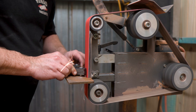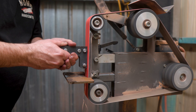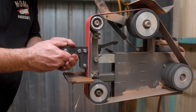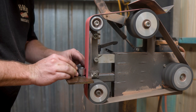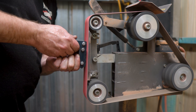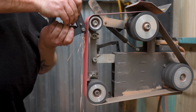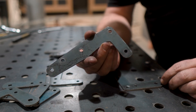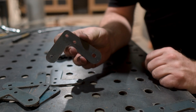I know this is probably the most ironic part of the project as I'm trying to learn more about machining, but I feel a lot more comfortable on the belt grinder for this kind of thing. I know I'm in for a lot of hours figuring out the rest of the parts, so this should save some time. We'll grind these down to the scribe lines, keeping as consistent as I can while we have them all clamped together. And that looks like they've turned out okay — a couple of my holes aren't perfectly centered, but because they're the same on both sides of the clamp I think they should be okay.